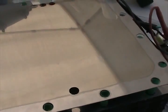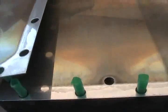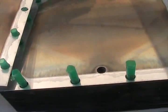I know everybody tends to want to rough up the edges to get the production up. I don't go that way. A dead smooth plate surface seems to be more efficient. You want more production, add some electrolyte to it. But you really can't push the plates or push the cells beyond a certain level of production. You do, and they just get inefficient. You crank the voltage up too much, you get inefficient. You crank the electrolyte up too much, and it gets inefficient. Heat is generated.